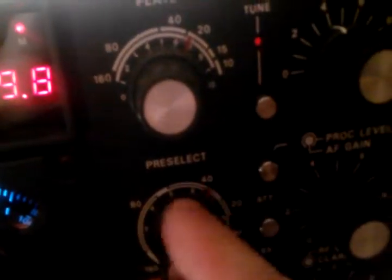We turn the plate to 20 meter, pre-select to 20 meter, and try to maximize the noise, which means we're basically tuning the pre-select filter to its highest amplitude level. The load control is basically a matching network to match the impedance of the transmitter output to the input impedance of the line and subsequently to the dummy load — which is 50-ohm impedance all the way through. This is set to number four, which comes from the manual, and then tweaked. It's also on lower sideband, so we're doing single sideband. The heaters are off right now, meaning the filaments are off, and I'm going to turn that on now.